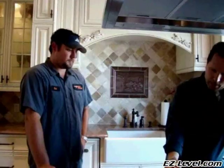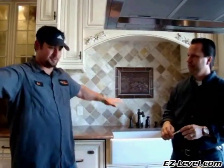We're here today with Matt Hubelacker. His family owns Granite Enterprises and as well Busy B Cabins. They do some of the best work in town. We're going to talk about the importance of a safe foundation for your granite. When you go to jobs to install granite, do you ever find that the granite is not installed correctly, that the cabinets aren't level? All the time. We set a level across it because if there's any voids between the cabinet — even though we shim our granite — if there's a void and somebody sits on it where there's just a shim here and a shim there, it's very easy for the granite to crack.